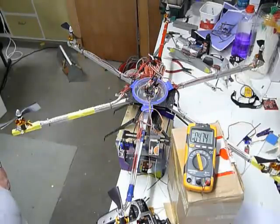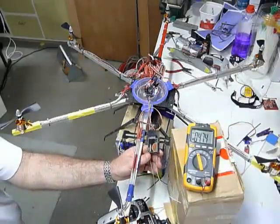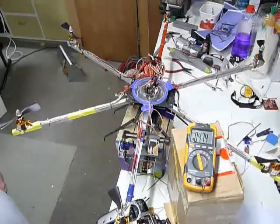All I'm trying to show you here is: be very careful with your UBEC. Make sure you have one that has sufficient volts to do the job. Because this afternoon when mine failed, it actually reset my board all the way back to factory default, set for an airplane. My receiver here — I'm using a FrSky receiver — it will work to the lower voltage, but it doesn't mean everything else around it will. Just some food for thought.